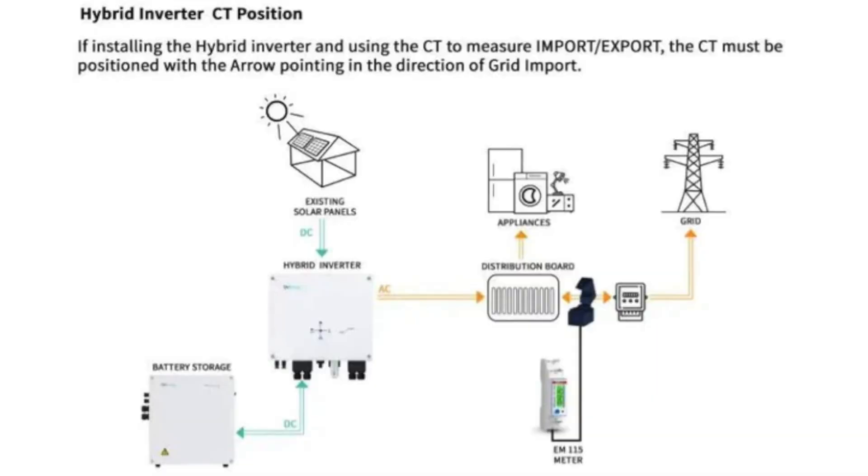The vast majority of installations these days are hybrid solar and battery setups. That means the batteries are behind the inverter and they accept DC input from your solar panels. This is much more efficient because it means you don't have to convert the energy coming off the roof to store it in the batteries. However, this also means that for the power in your batteries to be supplied to your home, it must pass through the inverter to be converted to AC electricity. A 3.6 kilowatt inverter creates a bottleneck.